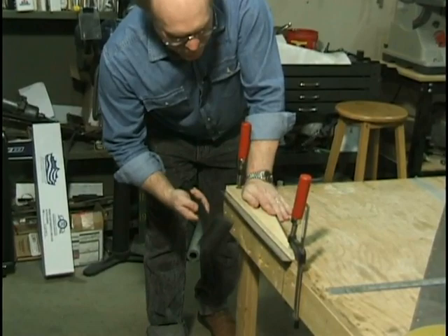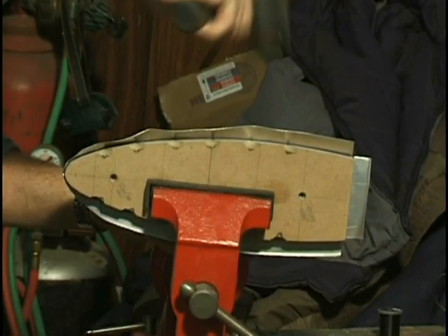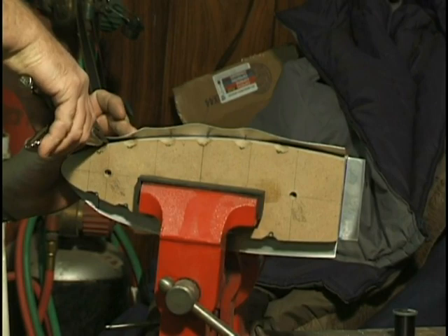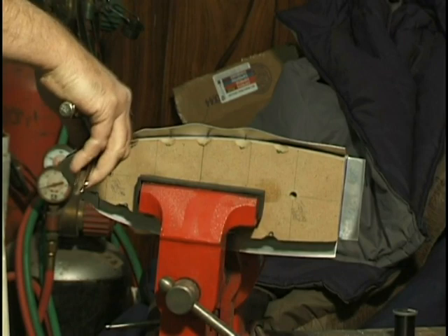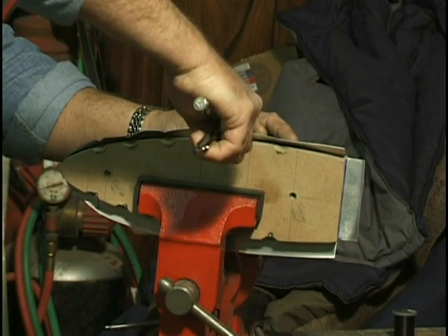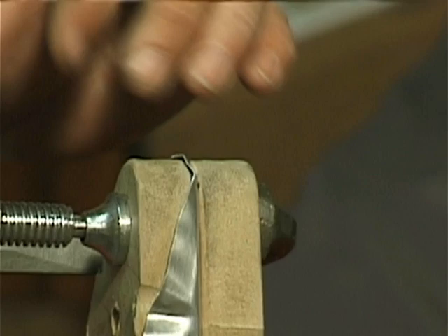Bending up from one end to the other and all the way back. Now we've got the aluminum started, but you can see it's already waving — it's already starting to not want to form properly. You can see where the reliefs are. We're just going to put a little bit here. As I pull on these, you can see things starting to straighten up just by putting a little indent in here, just training it a little bit. Instead of those big waves, we've now got a fairly uniform shape coming over.